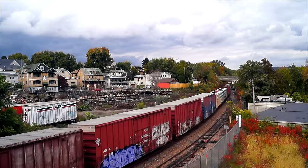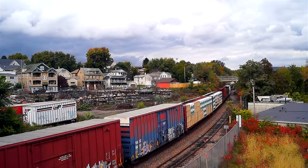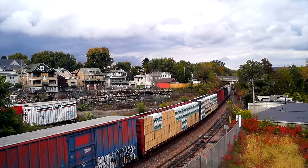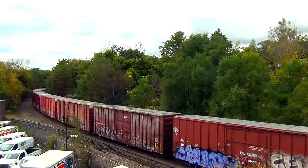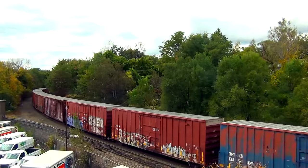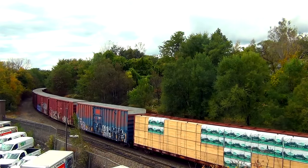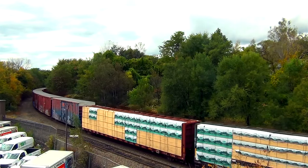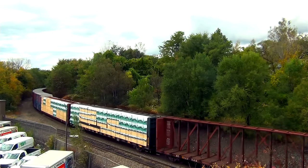The EMD 60 and 70 series locomotives will automatically rev up to about notch 4 as needed to try to maintain MR pressure, and Canadian National's SD70M-2 will go a couple of notches higher than that, to what sounds like notch 6. But even this is often not enough to maintain the proper MR pressure when charging a train in cold weather or to compensate for a large leak on the locomotive, like the MR drain spitter valve or the air dryer sticking.